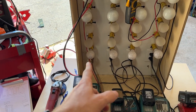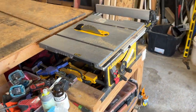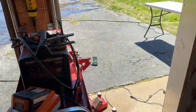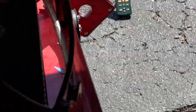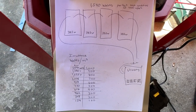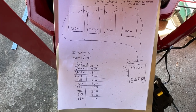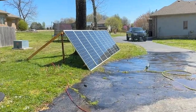On channel 1 I've got my power cord — follow the orange cord — and this goes to my table saw. So let's say we're on a job site with ideal solar conditions. I'm working with 990 watts per meter squared, and with a 1500-watt array — that's four 385-watt panels — that's almost a full usable 1500 watts of power DC direct.